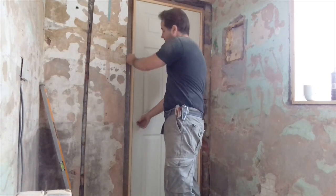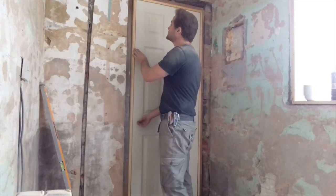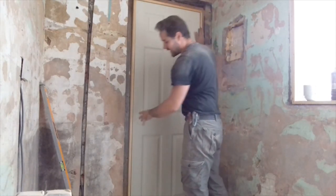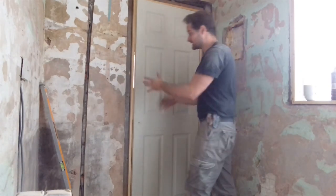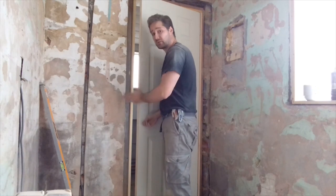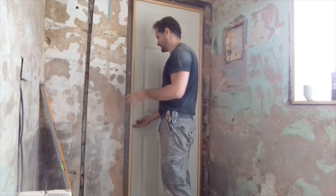I've got a tiny little gap — when I actually fixed this side in, it did actually pull the frame over a little bit, which is actually really quite handy, because it's just given me that little bit of extra space. So when I come and sink the hinges in, it just gives me that little bit more, and it makes sure when the door closes it won't bite into the frame. Otherwise you'd have to take the door off and plane it, and all that rubbish — because you can't plane down your latch side, you have to plane down the hinge side, which means you've got to recess with your hinges, and it's a platter.